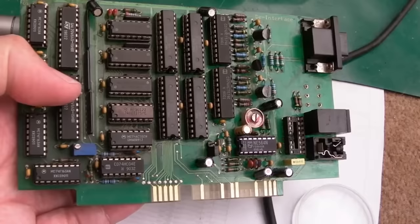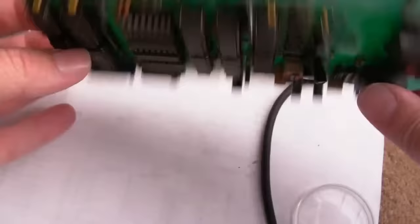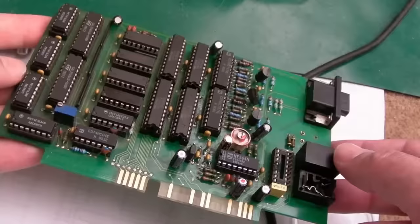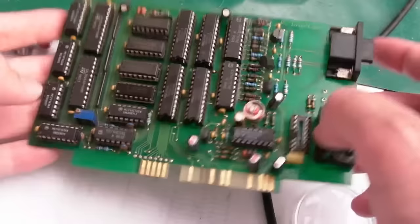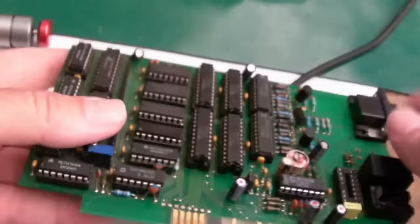Before that arrives I'm going to put this in the ultrasonic for a few minutes. As you saw when you pull these chips out, everything is yellow — the pins, the socket edges — the whole thing is caked in flux. The underside isn't too bad but there's a lot of contamination. I seem to be getting more of a picture as it's warmed up, which could point to caps — but all these have been replaced. I can't find photos from another angle to determine what size the tantalum should be. Someone definitely swapped that before.